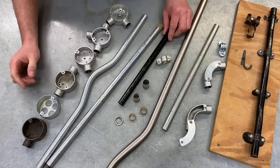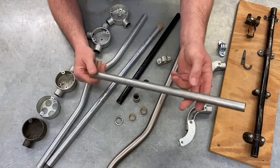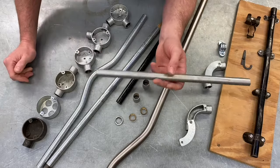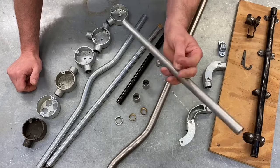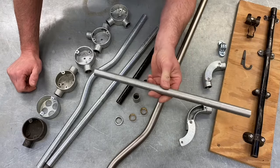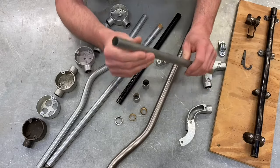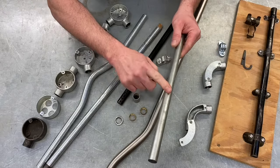The commonest conduit we tend to use now, inside and out, is zinc galvanized. It's not just galvanized conduit - it's galvanized with zinc. The exam questions will say: in order to prevent corrosion of a conduit system, what do you do? You add zinc to it in the zinc galvanizing process. So we've got black enamel and zinc galvanized as two of the finishes.